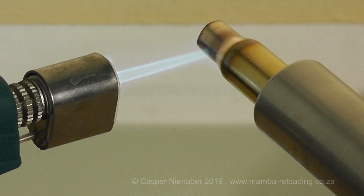This sequence of stretching and resizing a cartridge case creates stress in the microstructure of the brass. The result of this stress is that the brass becomes work-hardened and springy, with loss of ductility. The brass now resists resizing. When this hardened case is resized, it springs back to its fired form or size and does not grip the bullet correctly.